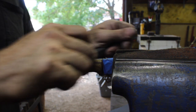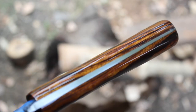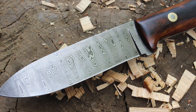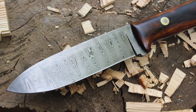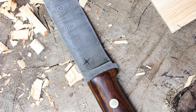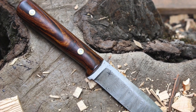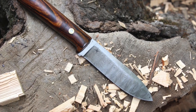Putting some Watco Danish oil on there — it seems to soak in pretty well on the desert ironwood, whereas things like boiled linseed oil will not, so I use the Danish oil, just plain with no stain. There you have it — the finished blade. This is going to be the last knife I make in Idaho for a while, who knows how long, but I'm pretty happy with how it turned out. It's going to a good home and will get used out in the woods, forged from some good Idaho sawmill blade steel. Appreciate you guys watching — we'll see you on the next video.